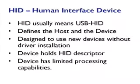So on these devices, the microcontrollers, the RAM is usually just primarily used for the stack. You're not going to have any type of allocation. They're all written in assembly, some of them in C, but there's no operating system. So they're just writing straight to the device. So even if you wanted to do this type of encryption or authentication on top of the channels that are provided, it's not going to work. That's why we have Bluetooth chipsets that offload all the processing and authentication to those particular chips, because the devices controlling them don't have enough horsepower.